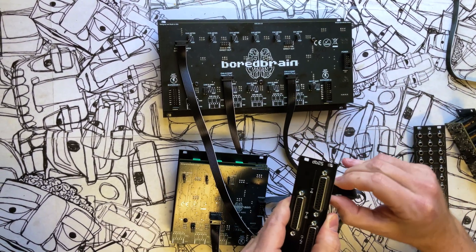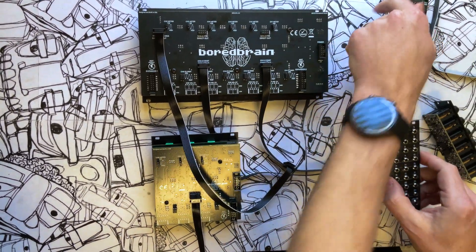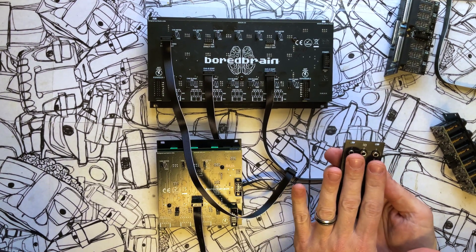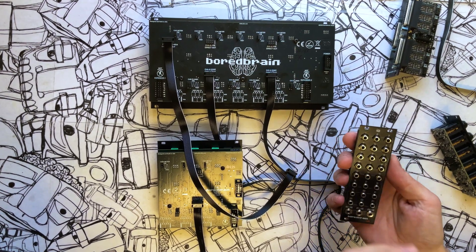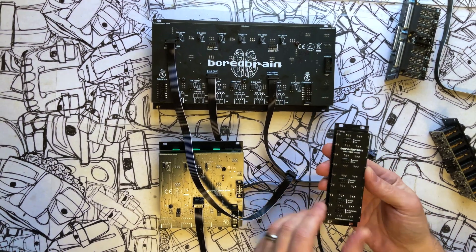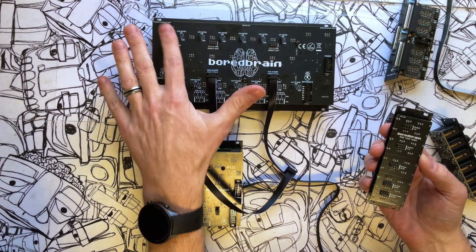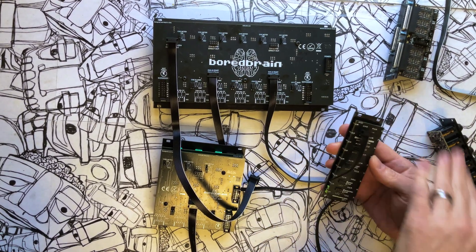Lastly is the IO module, which is completely passive. This will allow you to tap in and give you Eurorack level signals out here in your rack, which you can patch into something else to make a submix or record - for example using our Optics module, you could patch right from any channels you want directly into record. This one actually has five connectors on the back, so we could have a fully expanded system with two XP3 and get the returns and the master, all connected in the exact same way we've done it with the other modules.